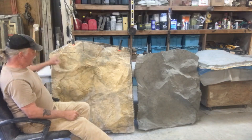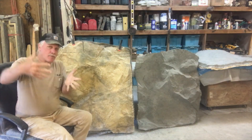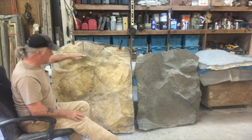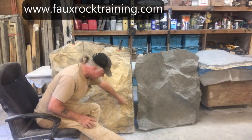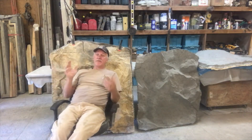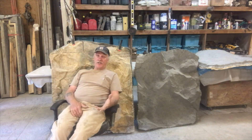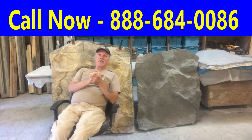I just made a mold of this original mold and you're going to see it on the table. I chose not to capture the rip area — I could have put clay in to prevent the rubber going into the rip, but instead I had my guys stop the mold right on the black line I drew. Since about 2008, I've told my classes: I spent a lot of time out in nature extracting molds — it's not ideal — and then I had the idea to make molds of molds.